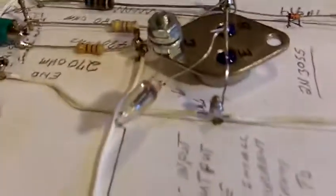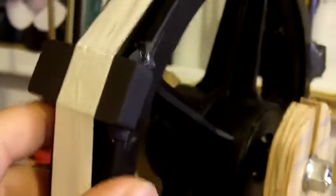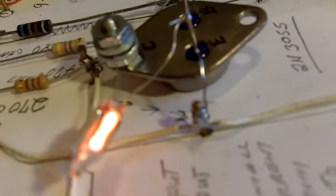This one over here is my first wheel project. It's a little wheel I ordered — bearings aren't too great in it, but it works fairly well. I'll fire it up. This has got the Radio Shack magnets on it, and I have some nylon fiber tape in there to make sure they won't come off. They were originally just hot glued, which seems to work quite well. I burned out one of the transistors, so I put a little neon bulb from the collector to the emitter to protect it. It seems to work quite well.